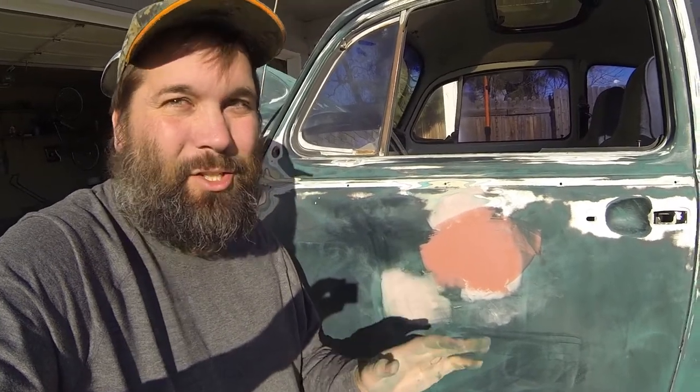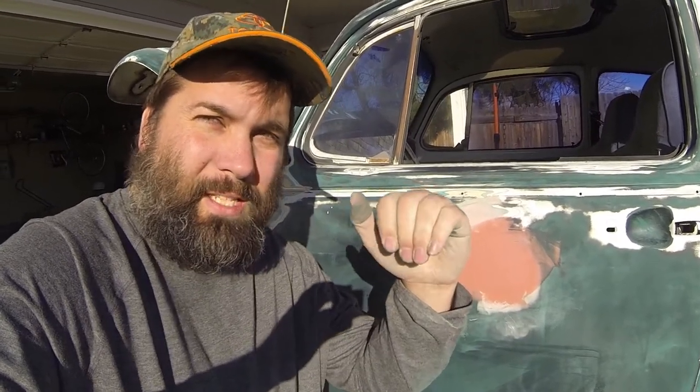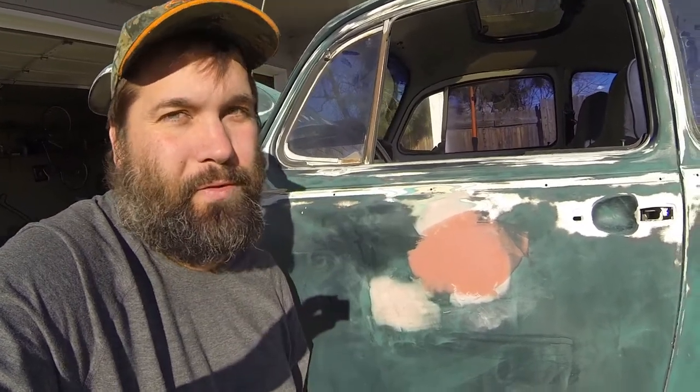If you've made the mistake and not cleaned your spatula well enough, that's okay. Just apply more filler. You're going to end up sanding most of it off anyway, but it will give you the thickness you need to be able to take out those grooves.